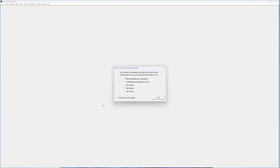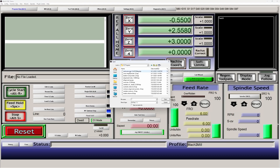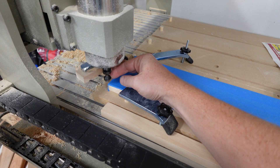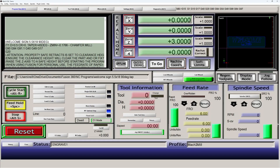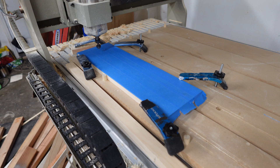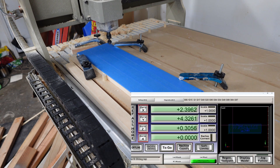With the stock secured and our bit in place, we're going to load up Mach 3 and load the G-code. I'll jog the bit close to the bottom left corner where I set my zero in Fusion 360, then press the zero button for all axes. One of my favorite things about the 6090 CNC and Chinese CNCs in general is they have hand wheels so you can adjust position after turning off the machine — I find this makes it really easy to get a nice zero every time. For the Z, I'm just going to use the paper trick: I lower the bit slightly until a piece of paper will drag under it, then lift the blade a little bit.